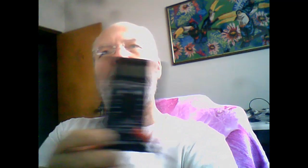This is the multimeter I was talking about — it's a DT830B. It has very simple features: resistance, DC voltage, DC current, diode mode and transistor mode, as well as alternate current and alternate voltage measurement. This is the entry level of this multimeter. It does not have a buzzer for diode test mode, and I installed the buzzer in it. I will show you how I did that so you can do the same. It's a very simple process and I hope you find it useful.